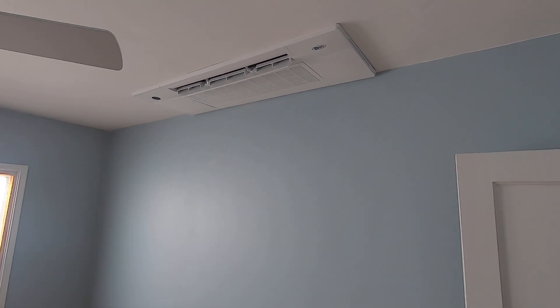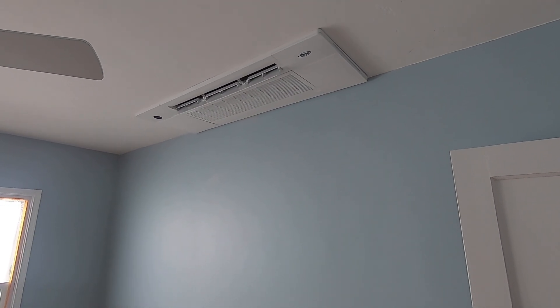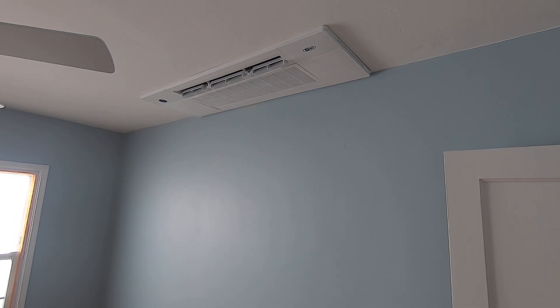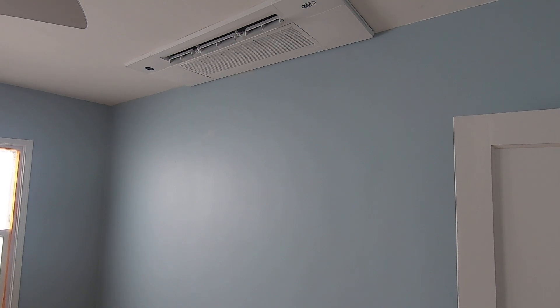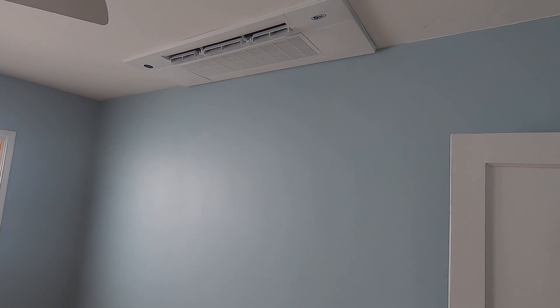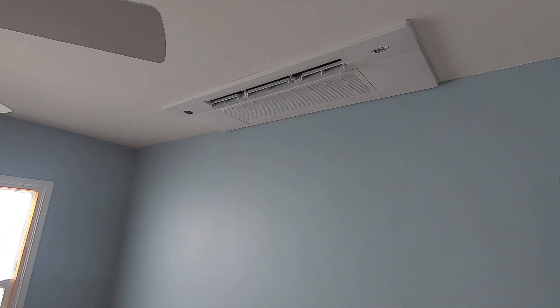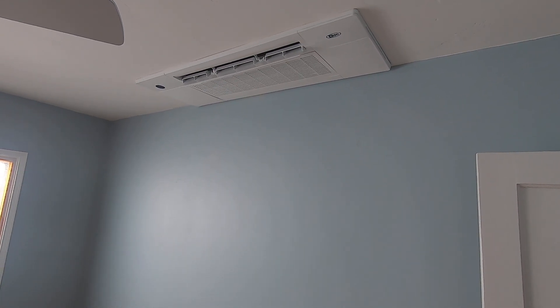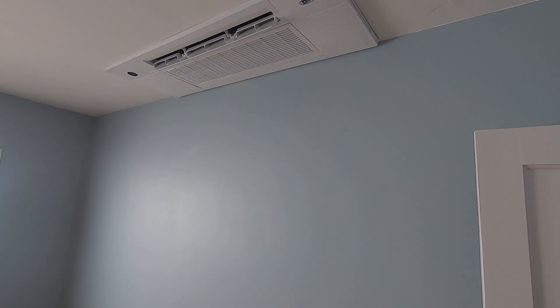One of the great things about this is each room is its own zone. If one person likes it colder than another, that's fine — you're not fighting the thermostat; each person has their own remote. It's important to note this system is one heat pump condenser outside with four zones inside. If you're in cooling mode, all zones need to be in cooling — you can't put one in heat and the others in cooling. In heating mode, all need to be heating, but each room can be set to a different temperature.